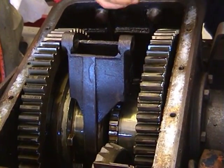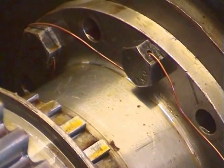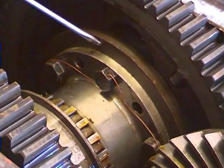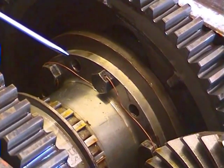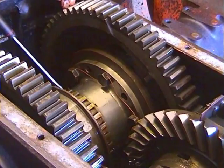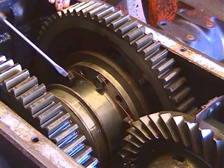Which I will lay with the cross shaft for reference. The final reduction gear has always been removed from the tractor and been faced because of its rough casting. A plate has been attached to the rough cast gear. Attached to the plate is a hub on either side of the tractor with serrated straight cut gear teeth, and a selector collar to lock the two gears together.